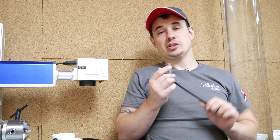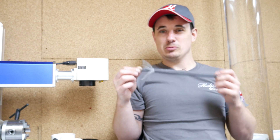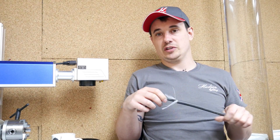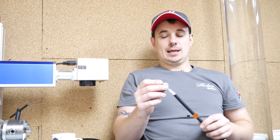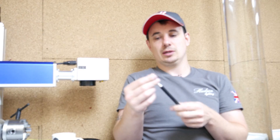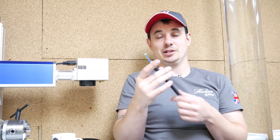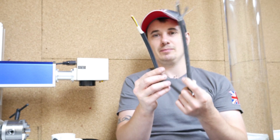For me, SWA would be the first choice for any low voltage installation because of the safety feature of the earthed armour, and in any case of burial. That said, I probably wouldn't choose it if I was literally just clipping it to the surface — it's your belts-and-braces cable. Next up is Hi-Tuff, also known as NYJ. It's a cable that's less commonly known — occasionally when talking to electrical contractors about garden installs they say they've never heard of it. It's basically a triple-insulated PVC cable.